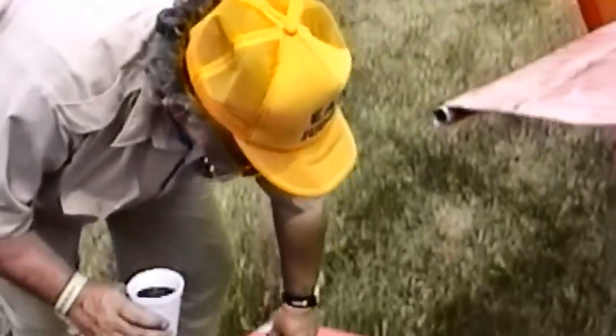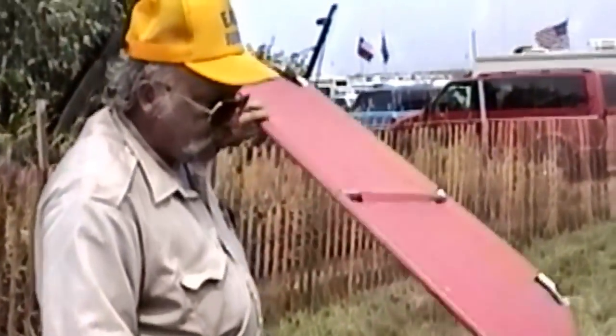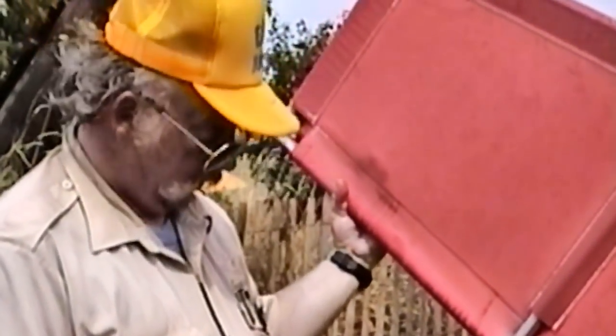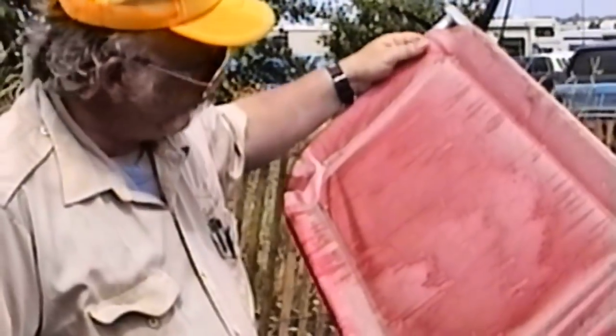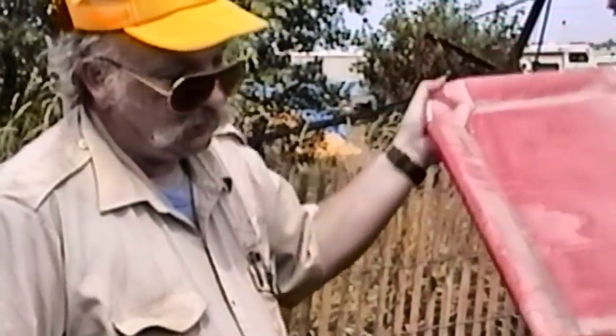This is one of our chairman's aircraft. From what you know now, would you say this is a good sail or a bad sail? Here's an example. A gentleman that owned this aircraft decided he was going to save his Dacron sails. This is the bottom. He made the mistake of not doing it early on. That's the bottom of the fabric, and you can see it's pretty well drawn — it's definitely lost its color. And then he did this. You don't want to do this. This is an example of what not to do. You do not spray a sealant over your structure. You cannot bring the Dacron back. Once it goes to the point where it's faded, that's it. New sails.